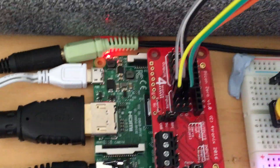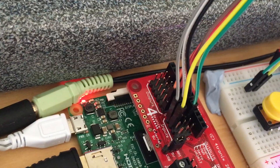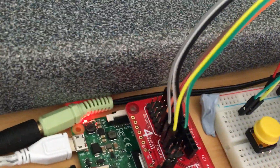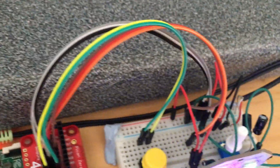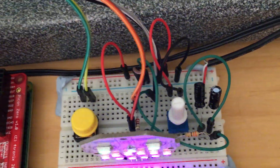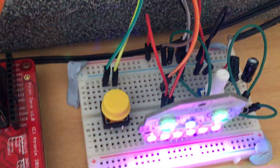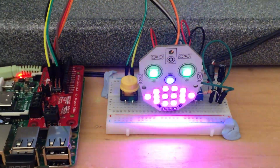If we look over at the PicoZero board we can see that there are three sets of connections to it. The green and yellow wires are connected to the button input. The black, white and grey wires are connected to the analog input and at the other end they are connected to the circuitry which is extracting the audio signal. And finally the red, orange and brown wires are connected to the PicoZero output and that is fed into myself and controls the NeoPixel LEDs which make up my face.